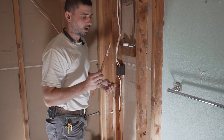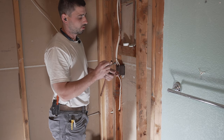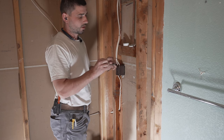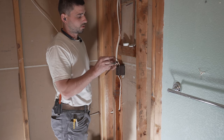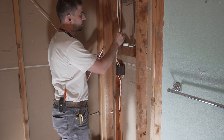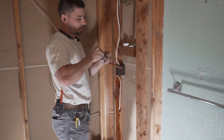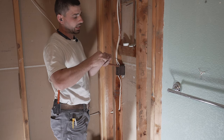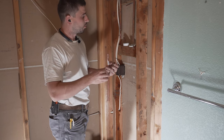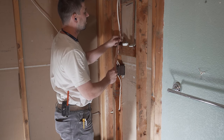Now there's some water based flux out there and it just is horrible. It's really hard to use. So I encourage you not to get those if you want a good bond. Okay, put it on there really good. Put it on in your coupler. And when you sand the pipe, the flux sticks better to it as well when you clean it with the brush. Otherwise, it tends to just slide right off.